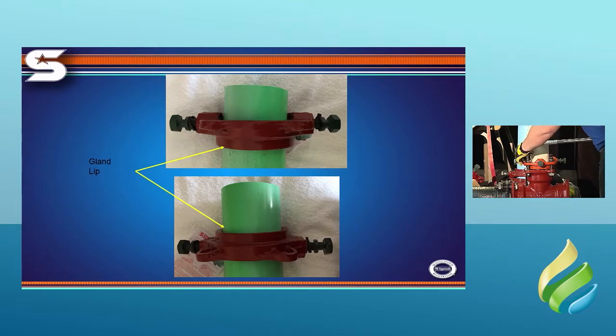I'm just snugging it right now. Star pattern or crisscross across ways. Snug this one up here. I'm just going to keep this from moving. So now we're pretty much snug, and every now and then you want to take a glance, make sure you haven't got any obstructions, you got the right thickness all the way around. Yeah. This one's looking good.